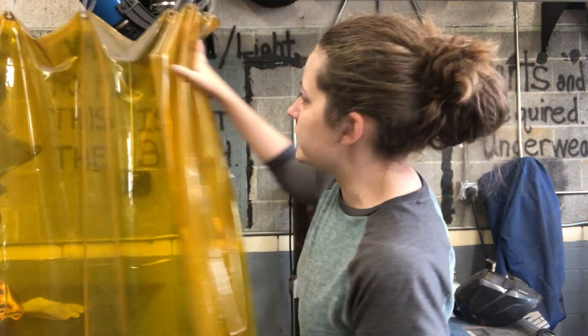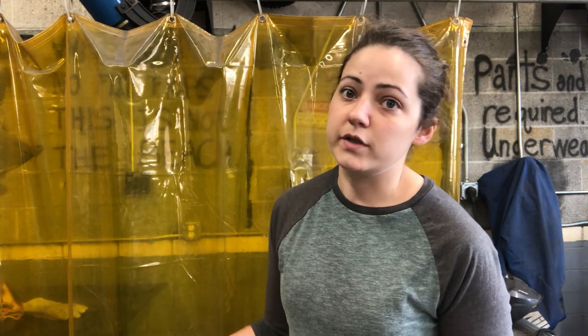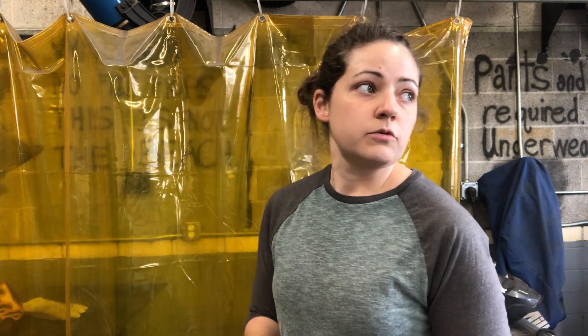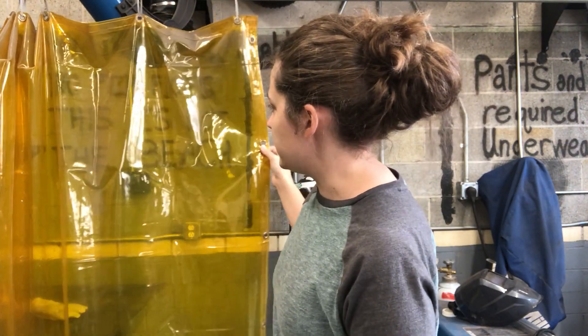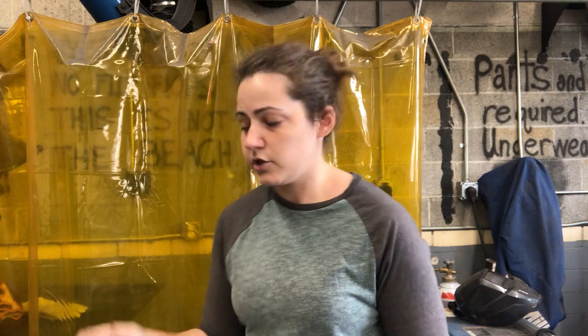You want this around so when you're welding at the table you can pull it aside — it keeps everyone aware that you're actually welding and keeps them out of your general area. It also helps protect eyesight, because the light from the MIG welder is so bright it can cause eye damage. This clues people in to stay out of the area and retracts some of that light. When you're not welding you just set it aside. Some come with stands so you can move them around the shop. It's kind of in the realm of PPE — personal protective equipment — protecting you and anyone else in the shop.